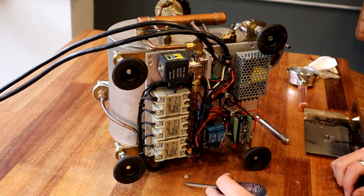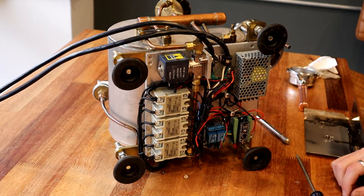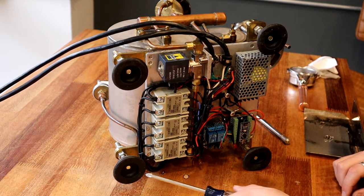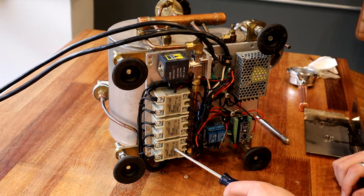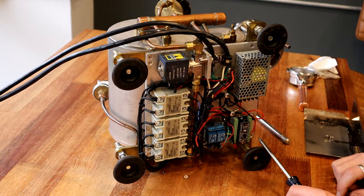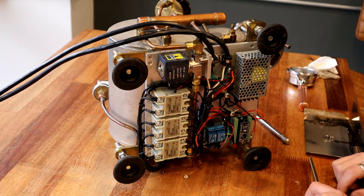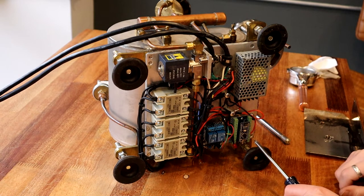You can see the steam tank inlet valve — low-pressure water comes in here and this valve pushes water into the steam tank. There are a few solid state relays that allow the controller to turn on and off the three heating elements: two in the steam tank and one in the brew group. There's also a pair of conventional relays — I'm only using one, and all it does is turn the steam valve on and off. This is a knockoff Arduino Nano, and I'm blown away that it's continuously operated for so long under harsh conditions without a single issue.